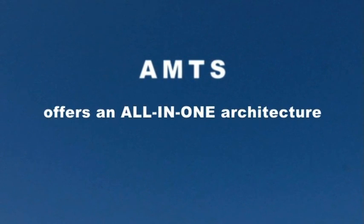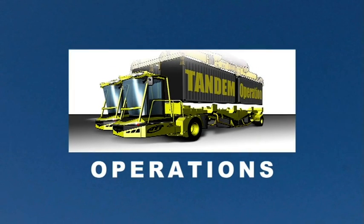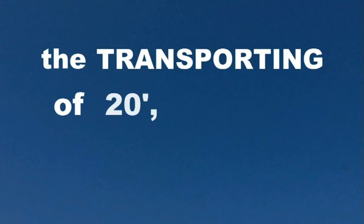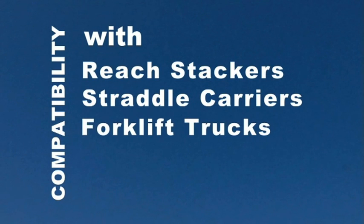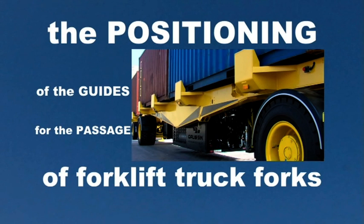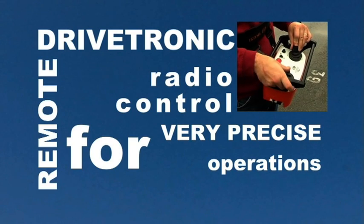AMTS is a train which consists of combinations of active and passive trailers connected by drawbars. AMTS offers an all-in-one architecture allowing twin lift, tandem, or tridem operations. It handles the transporting of 20-foot, 40-foot, or 45-foot containers, liquids or solids. It is compatible with the use of reach stackers, straddle carriers, or forklift trucks. The positioning of the guides allows the passage of forklift truck forks. Control by remote Drivetronic radio control allows very precise maneuvers.